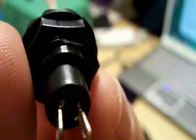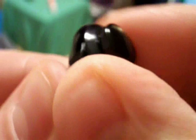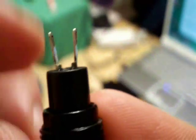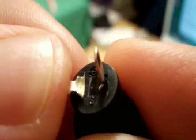Next we need to see if the momentary button fits in our hole. There are a lot of different types of buttons you can use, and most of them come with a bezel of some sort. With my application I don't need the bezel, so I just remove it and toss it away. With the prongs down, the button won't fit into the pen casing — it's too long — so I just bend the prongs one to each side. This will create room for when I attach the wires.